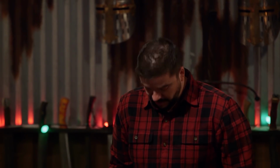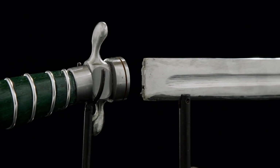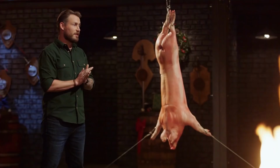Well, Pablo, tough break in 2 places. Looking at your grain structure, it's very coarse. You can see that from the heat treat. Also, you have some discoloration on parts of your blade right there, which is a stress riser. It will not kill. I know. All right, Pablo, well, you did well with the piercing, but it seems that there were some grain structure issues from the heat treatment and caused it to have a catastrophic failure during the kill test.